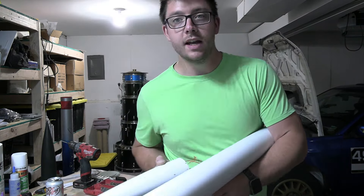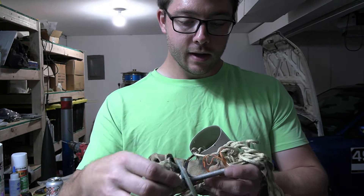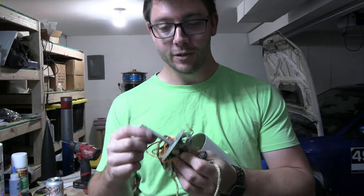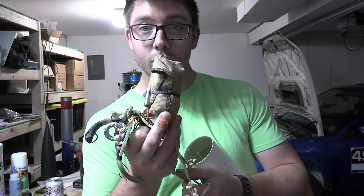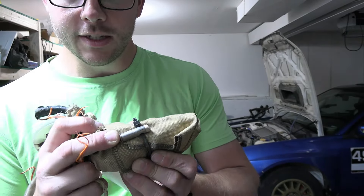I made a sled which unfortunately broke on landing. It packed a Featherweight Blue Raven and an Altus Metrum Easy Mini into a very small space. I used sealed vinyl tube charges like Tony Alcacer uses. I have a bulk plate and a forged eye bolt that basically screws into the top of the motor case. I had about 3 inches to fit all of those electronics.